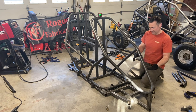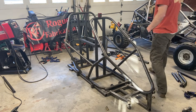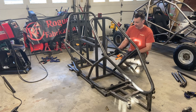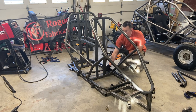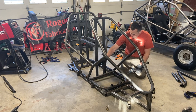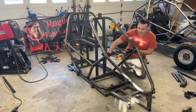If you look at the diagram and on your master parts list, part C44 is your main floor crossmember. This piece has an exact width between these two floor rails, and since you used the jig to assemble it, this piece will fit here. Since it's a crossmember, it should fit snugly. But you can make a second one of these, trim it down a little shorter, and use it as a reference. If you have two points across from each other, you can line it up, put a square on it, and if that's square where those two points meet, then the whole assembly is square.